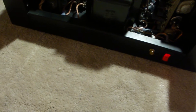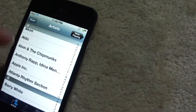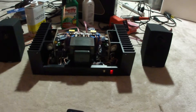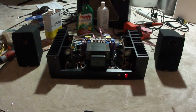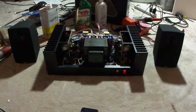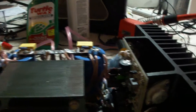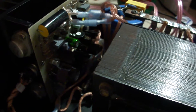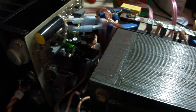I'll just play a bit. I always play John Denver's stuff, but let's change it up. What I did is a retrofit. This is a DH-200 power amp. I put PC-19C boards in there. It originally had PC-6. Basically, it's a DH-220 in a DH-200 chassis with a DH-200 transformer. These are DH-220 boards.